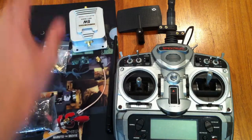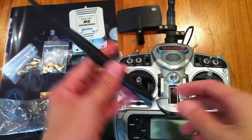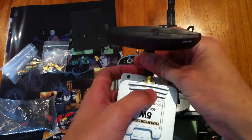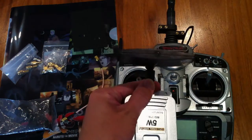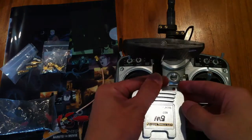The booster comes with a 5dB antenna. To enhance the range further, you could use a HobbyKing 7dB patch antenna. But take note that the beam width is actually only about 70 to 80 degrees, so try not to fly too far out to the sides or you're going to lose the radio signal.